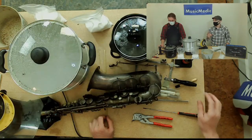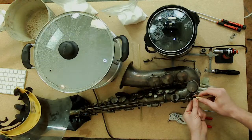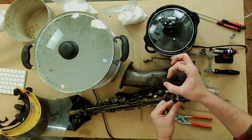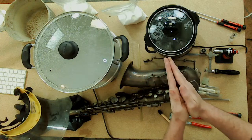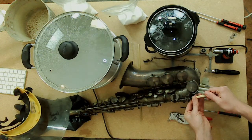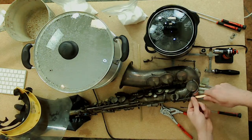What about the pin vise trick? The pin vise I really like to use when the rod is sticking out just a little bit. You can use a pin vise to clamp around that rod. I like using a pin vise because it has that clamping force that goes all the way around, versus this parallel action or even that scissoring action. You can tighten that up, use your Knipex to tighten that up, and then use this to work the whole rod out.